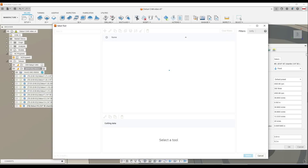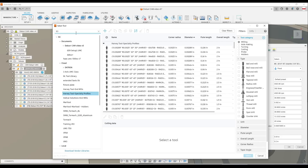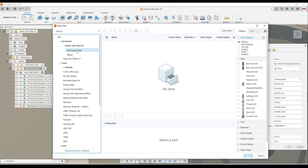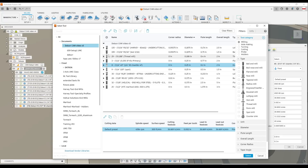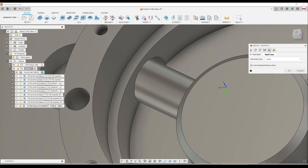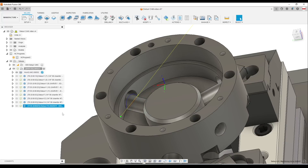3D deburr — select our tool. I've already got it as tool 135 in my tool library in Fusion, but you can download the Harvey libraries — I'll put a link in the description. Search for it by part number 834612 and they pop up. One pro tip: after you use the search field in Fusion, when you go back into your part view you'll need to clear out your search — it's really a filter to view your tools again. Pick tool 135. Change edges from automatic to selection, pick the edge, set machining axis to five-axis, and click OK. I click OK early on because it confirms I at least have a good toolpath started. If you accidentally hit escape, you lose all the work you've done. By hitting OK we at least create the CAM operation, and then I can go back and edit it.